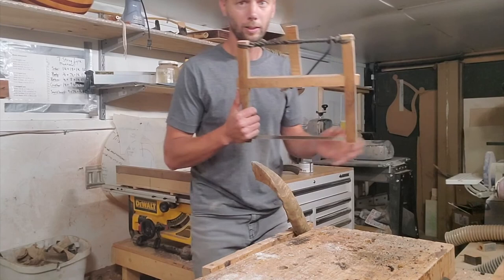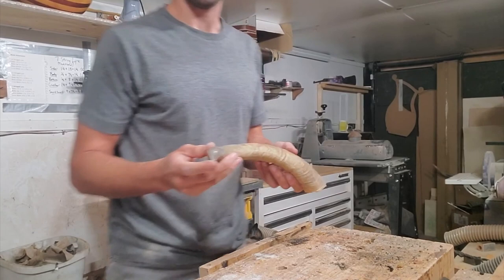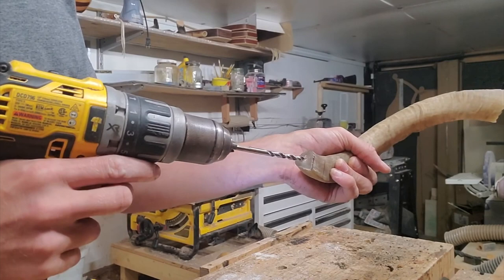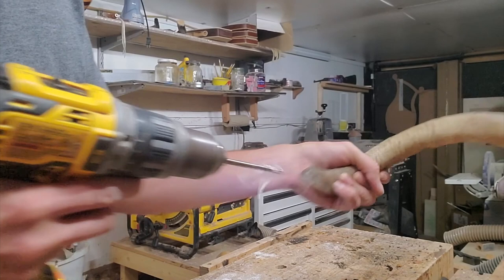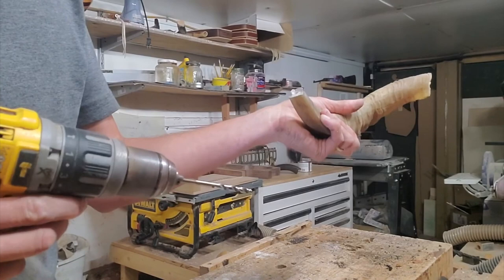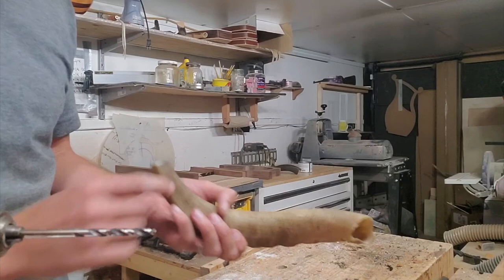This is just a frame saw with a hacksaw blade on it. That's what it looks like. At this point I take a 5/16th bit and I'm going to take a little bit off at a time, trying to follow that little white dot. I got it now. And if I blow here, it's definitely blowing through — so that's what we want.